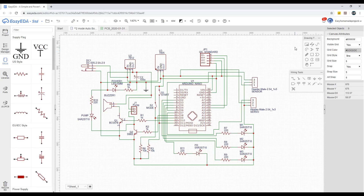I designed a circuit diagram for our project using EasyEDA free online software. The circuit is very simple. I used Arduino Nano for this project. There are two voltage regulators: a 12V regulator to drive the water pump and the buzzer, and a 5V regulator to drive the Arduino and I2C LCD. There are also some LED indicators.